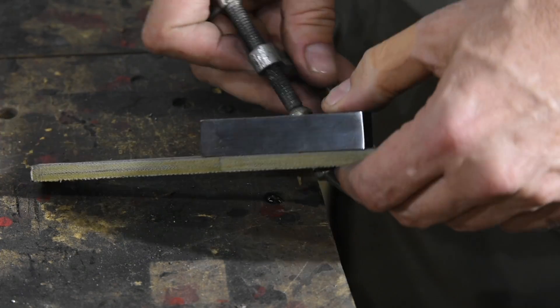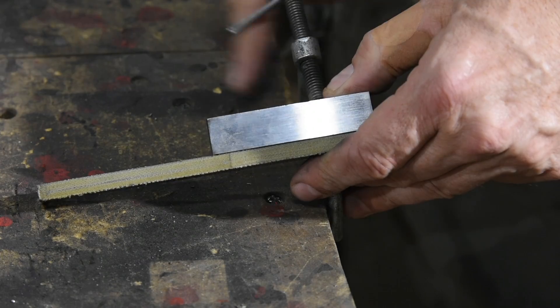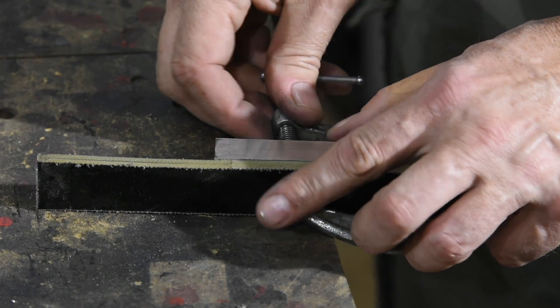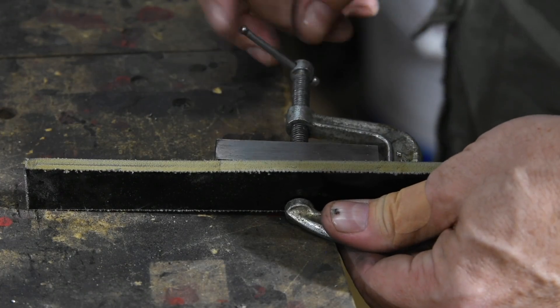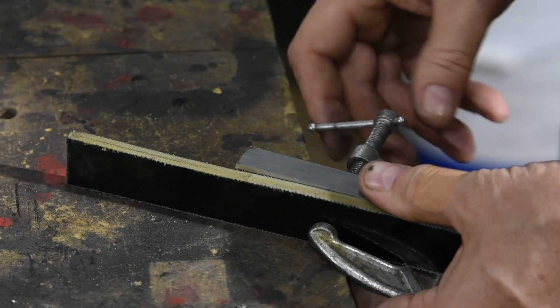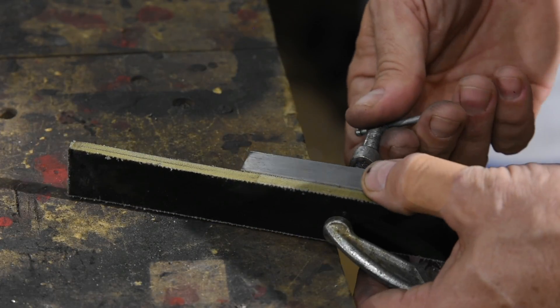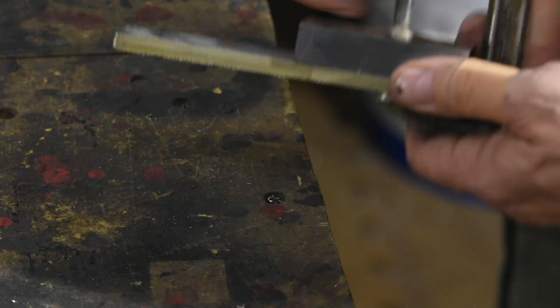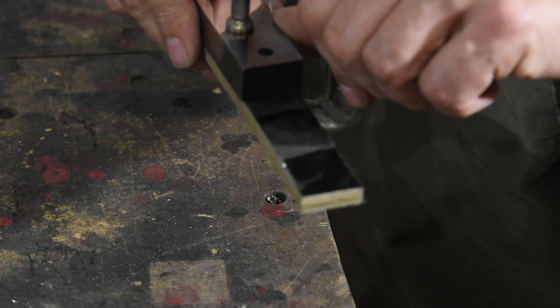Once you have the tool you could set it up in zillions of different ways — you can even do all your drilling with a hand drill and it'll still come out just fine with everything mating up perfectly, as long as you make sure it doesn't move between drilling the first hole and the second. You can do that by clamping it really hard, using locator pins, putting it in a vise — whatever suits the task at hand.